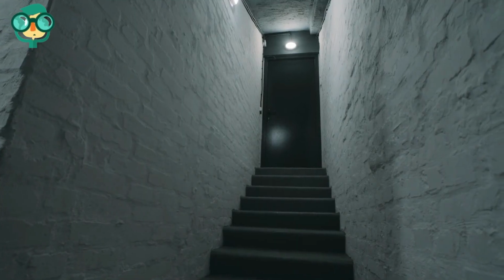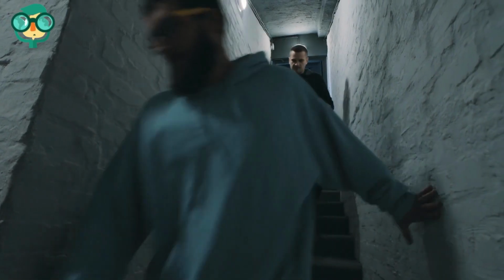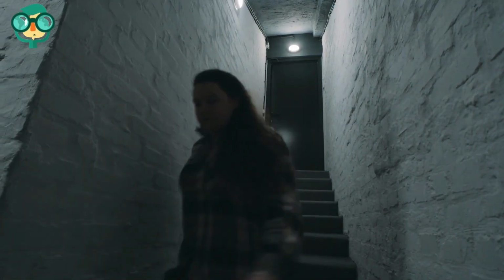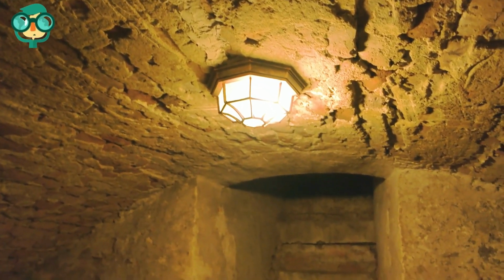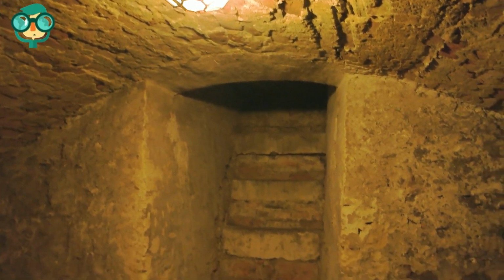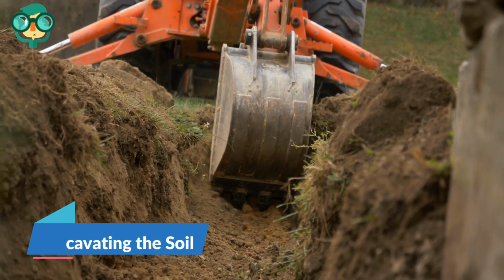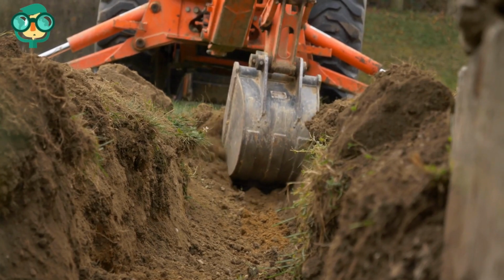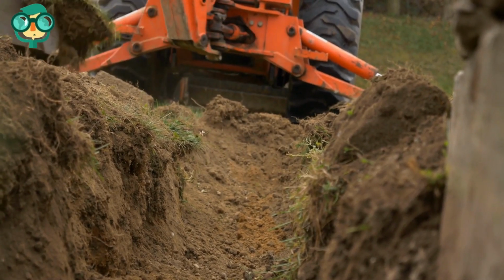or disaster. You can begin building a simple shelter by digging a trench and covering it with roofing logs and dirt. This type of shelter, called a pole-covered trench shelter, is waterproof and radiation-resistant when constructed properly. The first step is excavating the soil. Choose a building area on stable ground away from obstructions. Try to select stable ground where trees and buildings won't fall on your shelter.